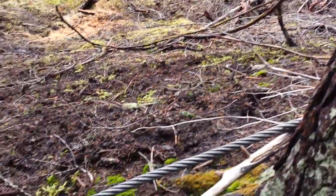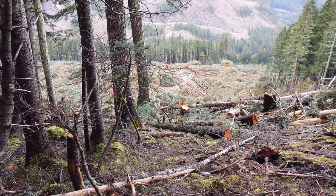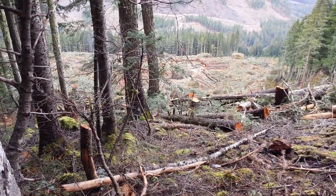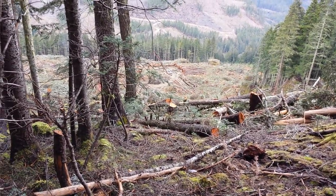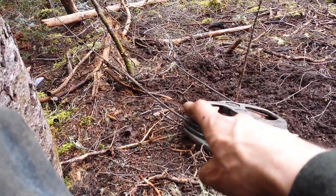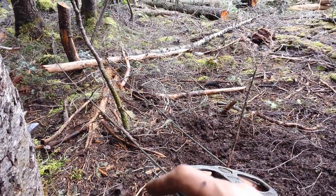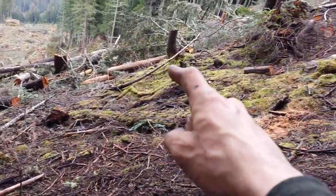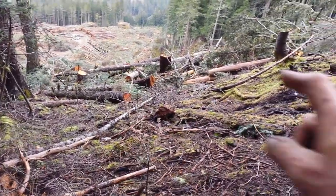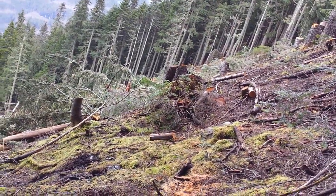We need to get them over here. What we do is he runs the lines around — it's actually two cables there — and where they meet and join together, those big cables he's using right now, he sets them down on the road, disconnects them from each other, and hooks up the skinny cable, same size as this here. He's got thousands of feet of it on the drum on the winch. So then he uses the big cable to pull the skinny cable, and the skinny cable follows the end of the big cable all the way out through the block and back down. So then it's all skinny cable out in the bush, which is light enough for a man to carry around — you can't carry that big cable, it's too heavy.